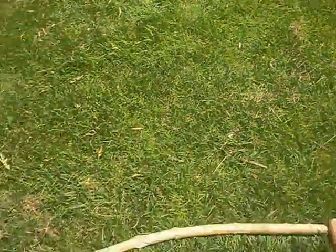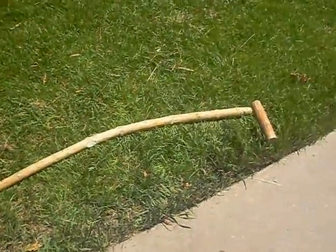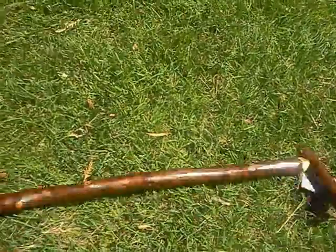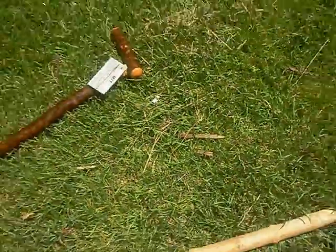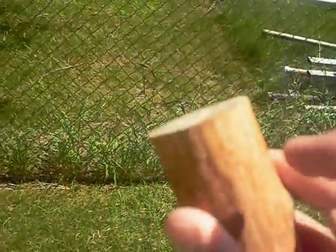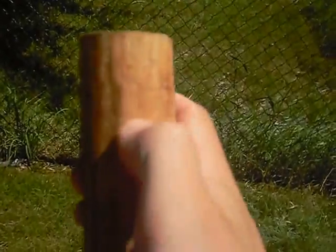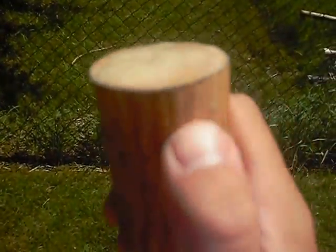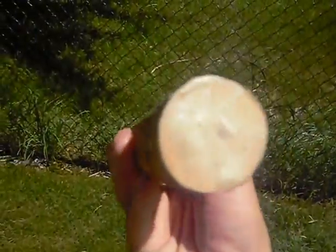But before it starts off, it looks like this. So, that's what you get. And that's the cane handle you'll get. This right here is a maple cane handle, which I drilled a Forstner bit hole on the bottom side. Always drill it on the bottom side before I round these off, you know. You just gotta round them off. That way it protects the grain too. Yes, it has wax on it.